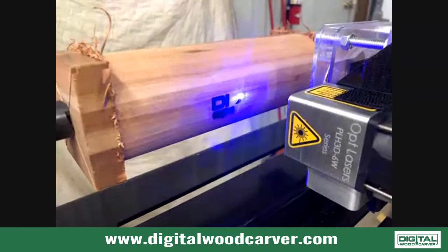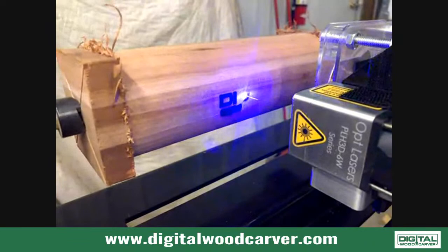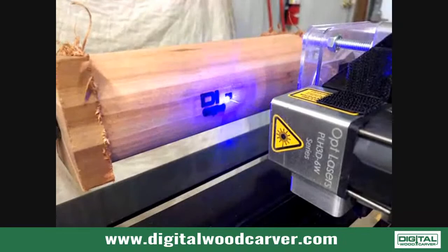The other thing that we had is you had it based off the radius, and I had to go in and recalibrate zero to be 1.4375 off from the wood. So a couple little things there, but once I got that toned down, that sucker is looking good. It's actually doing good. Burning in good.